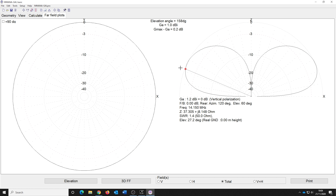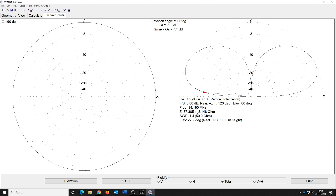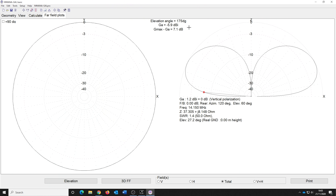The dilemma is a lot of people say why don't you measure the gain where that red dot is - it says up at the top 0.9 dB at 20 degrees off the horizon. I could just as easily measure it at 10 degrees, which says minus 1.7. But what I found is getting the really low angle stuff was very hard, so I started measuring all my models at 175 degrees, or five degrees off the horizon - it says minus 5.9 there.